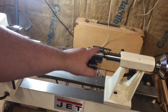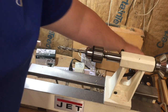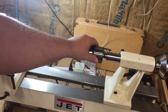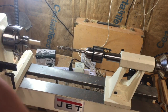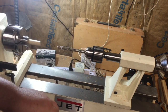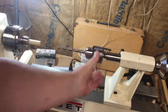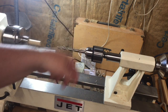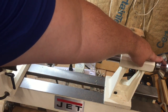We're not going to use that. Instead, we're going to use this drill chuck because you can pop these out and put different pieces in the back. What happens when I put the drill chuck in — on this one I happen to have a Wood River drill chuck for a half-inch collet, and I did like the keyed locking. I just find it gives me a much better attachment because I know the bit isn't going to move out of here. Now this doesn't turn, so my bit isn't going to turn. What's going to happen is the workpiece will turn and then we'll feed the bit into it via the hand wheel that's over here on the other end.